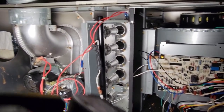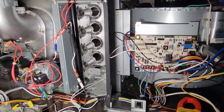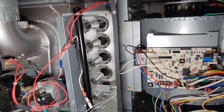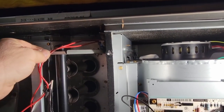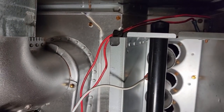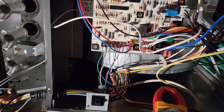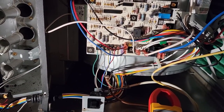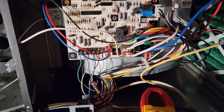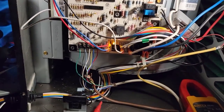Either way it should be built for that, but generally you don't insulate the top of the furnace like that. Originally this was a 90-percenter, then that obviously got changed to an 80, which we don't normally recommend — running a 90 up in the attic in cold weather is not usually the greatest idea. I got the flame sensor cleaned up, repositioned the wire so it's not over top of those slits in the metal, and brought the flame sensor out the front. I find it peculiar — it should be giving a code, otherwise it's got to be the control dropping out.